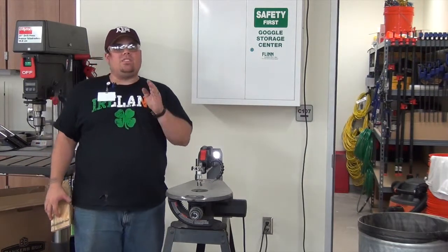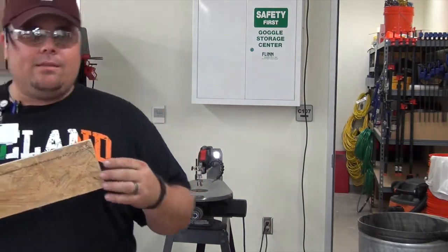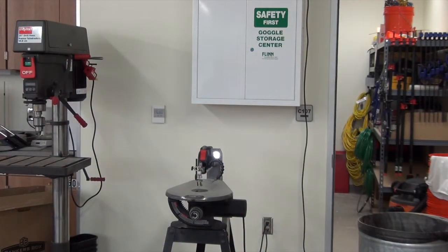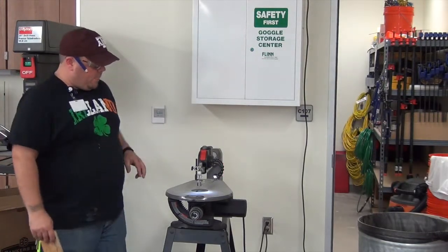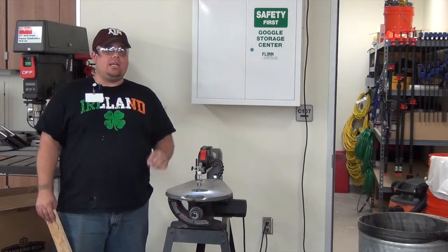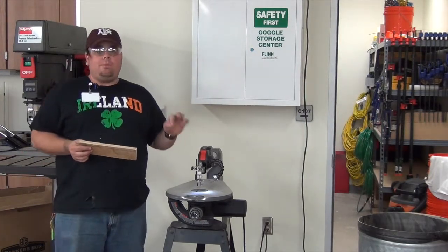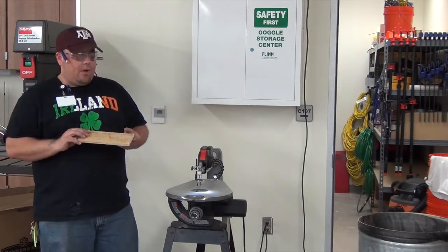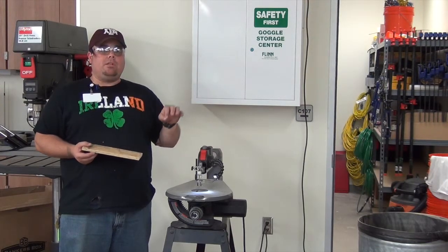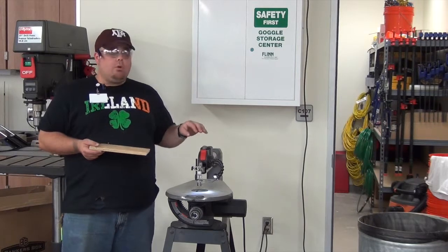The advantage of the scroll saw is you're not limited to straight cuts like you are with a circular saw, a table saw, or a miter saw. The good thing about this is that we can draw the line that's really going to show the cut that we want, and this saw is going to allow us to do that. One thing to pay attention to is the number of teeth on the blade. A very high tooth count where the teeth are very close together is for harder material like metal or very dense plastic. A saw blade meant for wood is going to have teeth that are slightly farther apart. If you're planning on doing lots of scroll work and moving the material around, you'll want to run at a fairly high speed. If you're doing precision work and moving very slowly to keep your line true, run at a slightly slower speed.